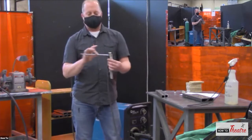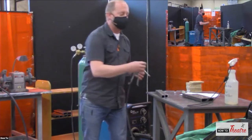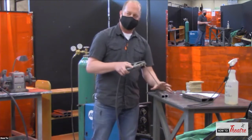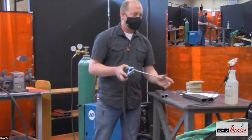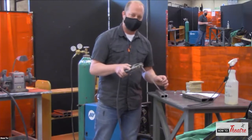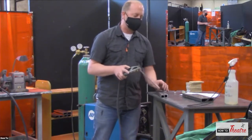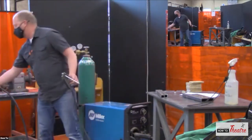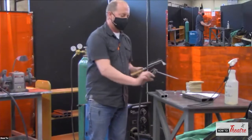In arc welding, the rod is covered in a flux that becomes the shielding agent. That flux burns off as you're welding, and it's pushing those bad elements out of the air, pushing them away to make a nice little environment. That slag actually cools on the weld as you're going, so it helps protect it. So when you're done using an arc welder, you have a skin over the weld, and it's a very thin skin.